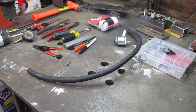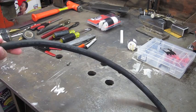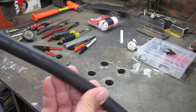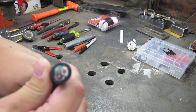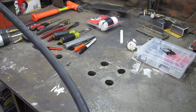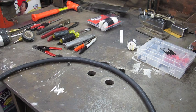I'm going to go ahead and make an adapter using this cord here which I got at a local big box. This is a 10 AWG three-wire cord. You can see here at the end that it's white, black, and green. The reason I selected this wire is because the manual that came with the 200DX specifically stated that minimally for an extension cord you need to use a 10 AWG wire.